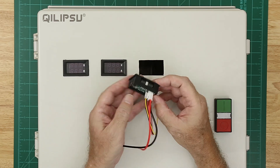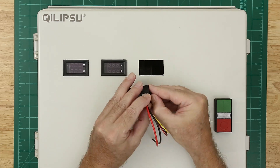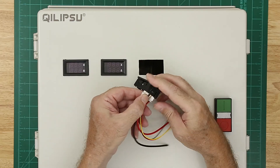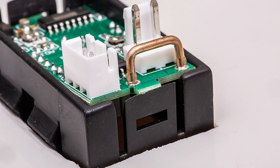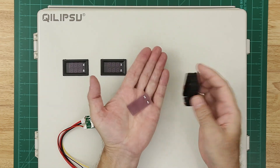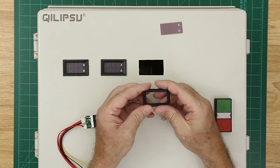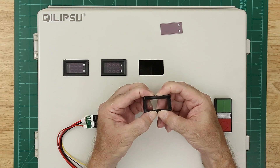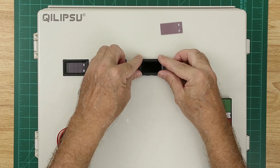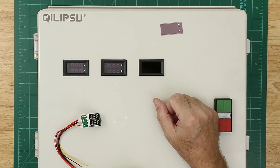The solution I came up with was to remove the circuit board. There are little tabs on the side — you grab onto those, pull it out a little bit, and lift the circuit board out. With the circuit board removed, there's nothing stopping the clips. Here's the lens inside with the volts and amps display. The plastic shell will flex quite significantly, so with the circuit board removed you can pop them in and then place the circuit board back from the other side.